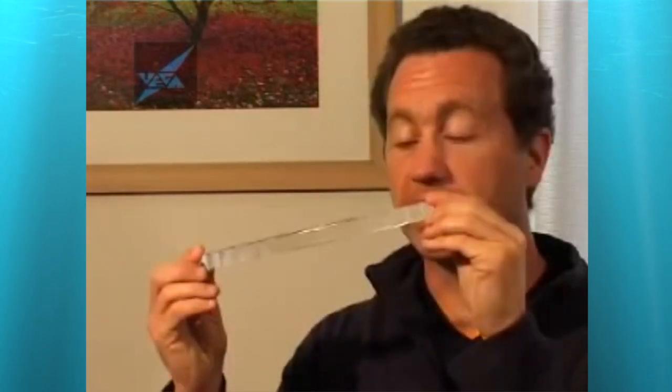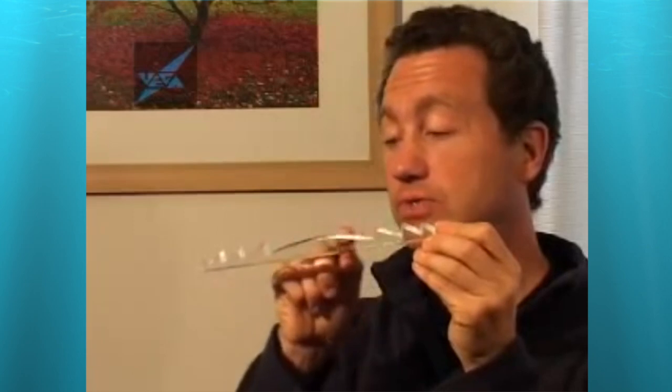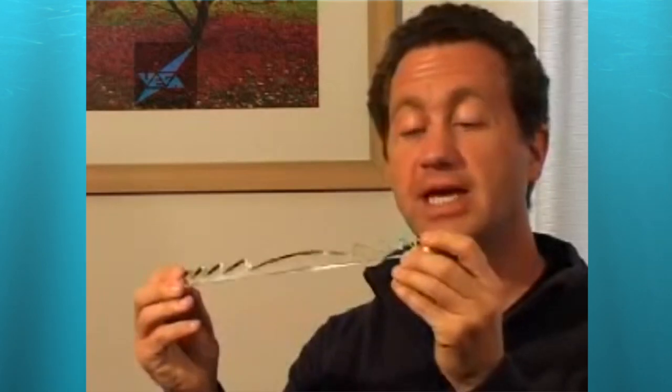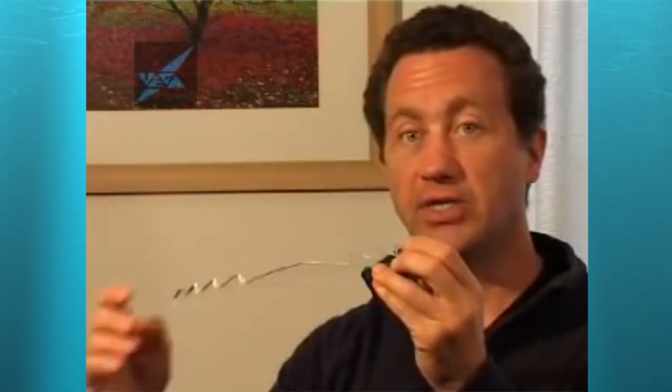You can make a lens with the same optical properties but much thinner. And that's what he did, and you end up with this rather curious-looking lens — the Fresnel lens. The central section is here, and the other segments go along the length, with exactly the same curvatures as the big lens, but much, much thinner. So it's much lighter, and it doesn't absorb the light nearly so much, so you end up with a much brighter beam of light from this beautiful lens.